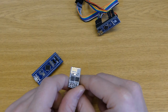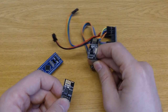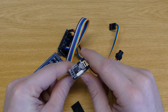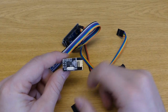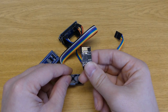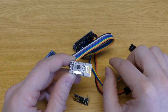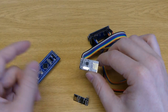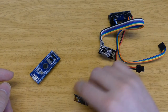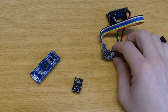One reason I use the ESP8266 is because I wanted to play with it — I had it lying around. The NRF24L01+ is really good for low-power applications because Wi-Fi can consume a lot of power and needs to reconnect frequently, while NRF uses a simpler protocol with lower power consumption. However, in this case we have mains electricity nearby, so power consumption is not a concern, and the more power-hungry Wi-Fi module is perfectly fine to use.